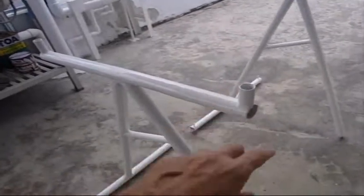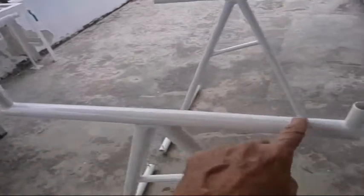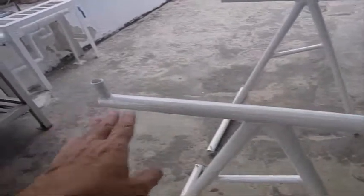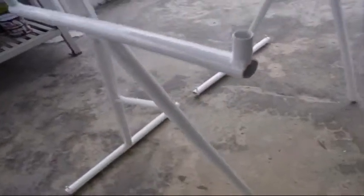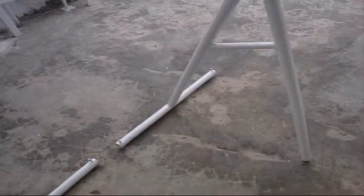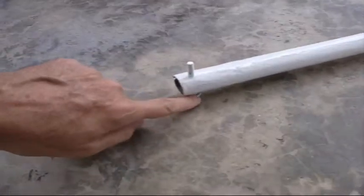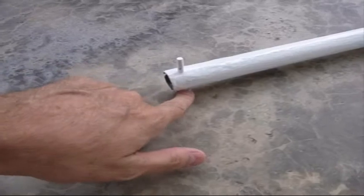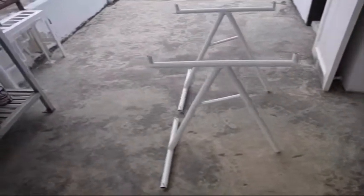I've added some pieces to keep the tubes from sliding off. The pipes were warped from their earlier use, so I oriented the bending so water won't collect inside and rust them away. I'm not putting end caps on the stands because I want any water that gets in to drain out — I want them to stay dry. I've also got adjustable legs made from stainless steel screws with a nut welded on the bottom.